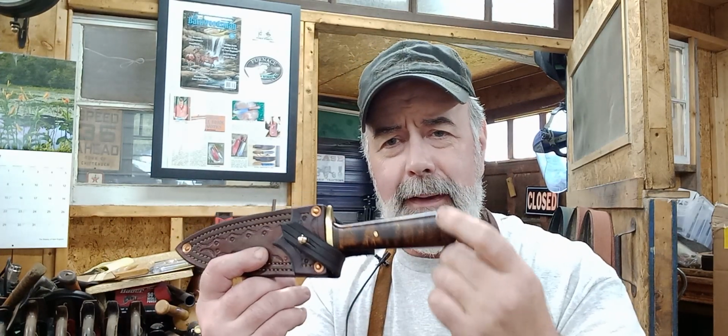It's one of those knives where you have to be very careful when you're grinding, because if you go down too far, you hit the tang that's glued inside the handle, and it's completely ruined. You'll have some moments of, oh no, did I cut down too far? So I got to be right on my game when I'm on the grinder. You always have to be on your game when you're on the grinder, on the 2x72 belt grinder.